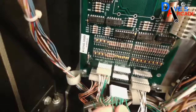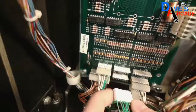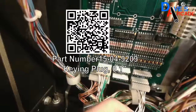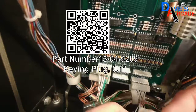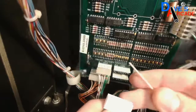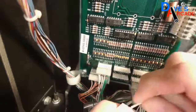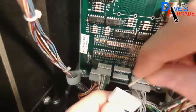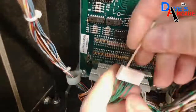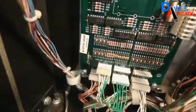Now for the last part — the key. You can see how I have one space left open for the marking on the board. You can buy plastic keys, or sometimes you can pull the piece out of the old connector and reuse it. But in a pinch you can also use a toothpick — just shove it in the end and break it off flush. There you go, a homemade key. I can plug it in and that connector is done.